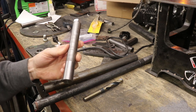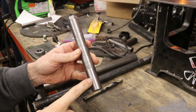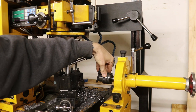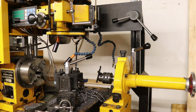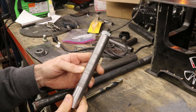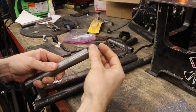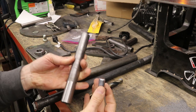I'm pretty happy with how this turned out. On the bottom you can actually see it is a much nicer finish down here — this is the point at which I actually learned how to use the lathe. I very simply did not tighten down the part that stabilizes the tailstock, which caused a little bit of wobble in the shaft as it was spinning, and that resulted in a rough finish up top. But I learned something today, and that is a major thing. On the top we've got this nice little custom-sized bolt that we had to trim down, and I'm very happy with how that turned out. Everything is what we need to do the rest of this job.